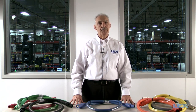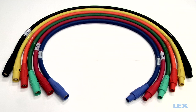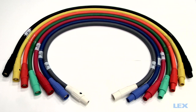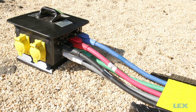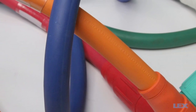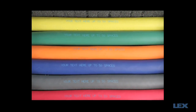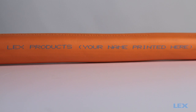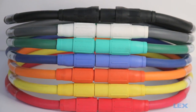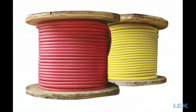Now let's take a look at some of the cable options available from Lex. Lex Portable Cam Type Feeder Extensions are now available in seven cable colors with matching color cam connectors, which aid in phase identification and help to prevent mismating of cables. Colors can also be used to designate company ownership and to prevent mixing of cables on job sites. Lex also offers custom legend printing along the entire length of the cable to build brand identification and deter theft. Cam extensions are available in custom lengths up to 200 feet. Male or female cam type tails and bulk cable are also available.